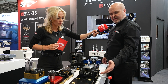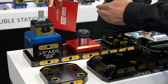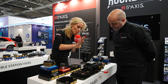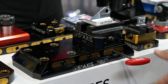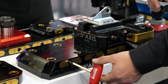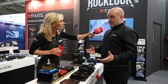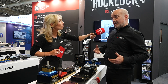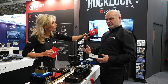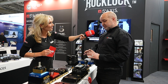We have small single plates and also a new three-fold plate which allows you, as you can see from the workholding here, to be very flexible in what you're holding — so many different setups all on one machine. This system is a little bit different to others on the market. A lot of our bases are made from aluminium. Benefits of aluminium? It's lighter — you're not trying to reach into your machine tool and pull out something very heavy, which is strenuous on the operator. There's also vibration dampening — through steel parts you sometimes get chatter in the tool that works its way down the fixture, and the aluminium base helps to dampen and take it out.